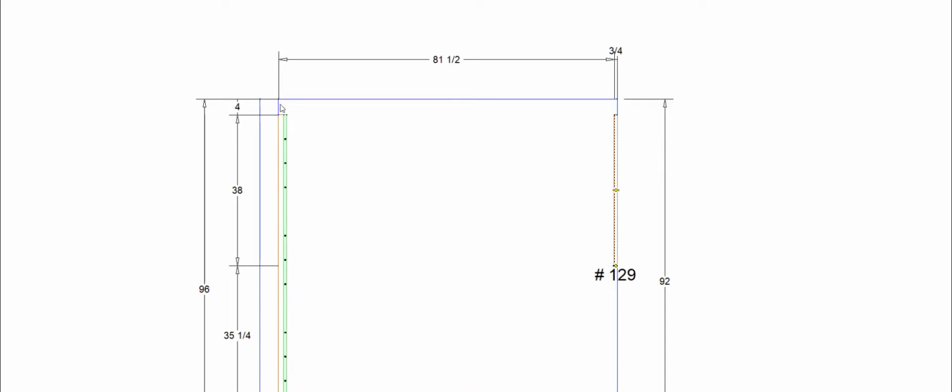leave a 2-inch gap. You might say, I don't want to see the gap, but your eye doesn't get drawn to it. If you try to go, say, 3 3/4 and leave a 1/4-inch gap, and then there's a huge amount of variation in the thing, it's going to have a 1/16 in one area, a 1/4-inch in another, a 1-inch gap in another. It just draws your eye. So try to not draw your eye to anything that's not perfect.